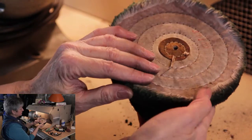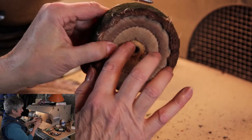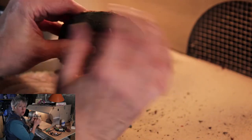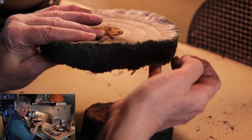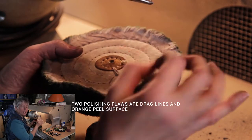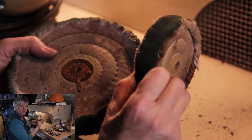I've got a couple of choices here. This one is bigger and also softer. This one is smaller in diameter because it's been worn away — you can see the stitches right there — so it's a bit harder. Generally speaking, harder is better for flat surfaces; it's more like a lap. But it may leave its own lines because it's a little bit harder. The softer one is going to refine the surface more, but we'll have to watch that it doesn't create a typical polishing buffing flaw — very tiny drag lines, or sometimes we call it orange peel, which looks like tiny little dots all over the surface. I'm going to try the harder one first and see what kind of surface I can get.